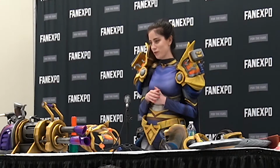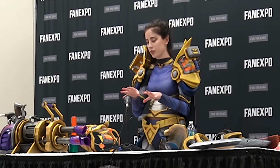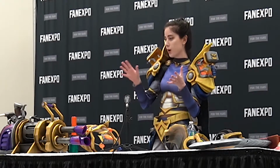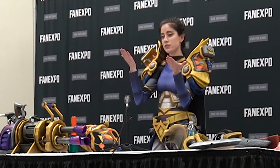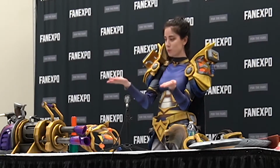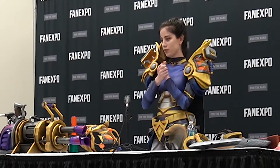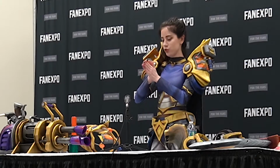Are you heat treating after? Probably not. Okay, well that's actually a good thing that you're not doing after. With contact cement glue, the proper way, I don't know if you're doing this or not, typically solves a lot of problems. Apply it on both pieces, wait for both pieces to fully dry, and then attach them. Don't attach them while they're wet. Oh, that would do it. Yeah, if you're attaching them while they're wet, it's more likely to slip.